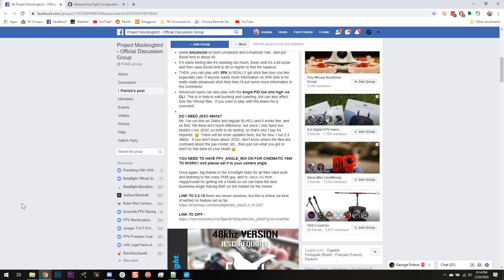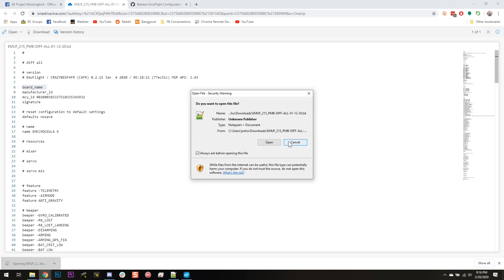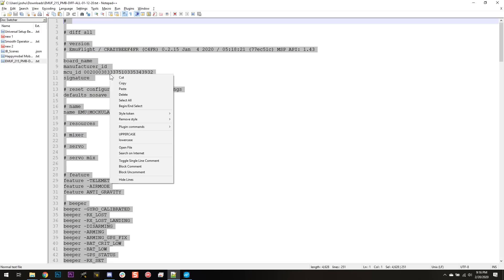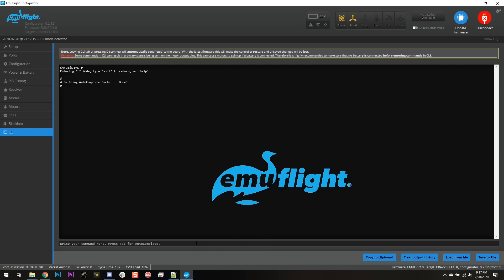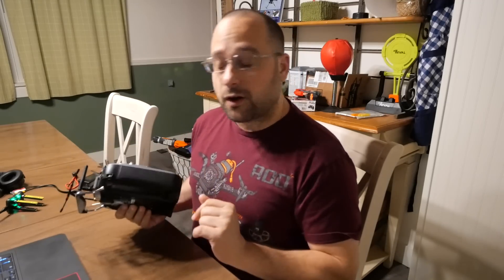By the time you're viewing this video it may be out of beta, but again, link in the video description. The first thing we need to do is download EmuFlight version 0.2.1.5 or newer — they have a direct link to this binary on the Facebook page. Here is the config diff. I'll just download it, open it, select all, and copy. Click in the text box, right-click, paste, and enter. Although we've got a config dump pre-made for us, there are a few things I'm going to need to tweak in order to get this working with my transmitter — we need to check the channel map, the arming switch modes, and so forth, the same way you do when you set up any new device. I'll take care of that off-camera and then we'll come back.